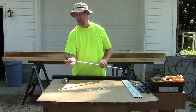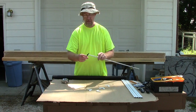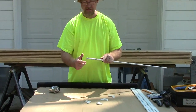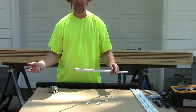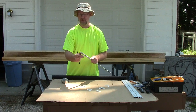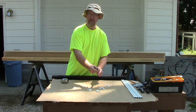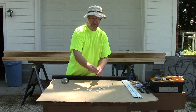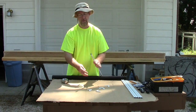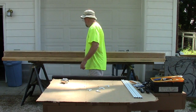After you cut, it's going to be kind of rough there, so what I do is I file that down. This is a little small file, but any file will do. In some instances, if you cut it long, a 16th or an 8th, you can file it down to the correct length, or you can go to a bench grinder and just eat it away very slightly until you reach your mark. That's much quicker, but you can do it with a file. Alright, so that's the length we're keeping.